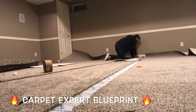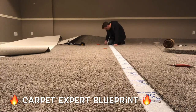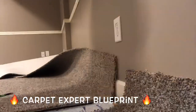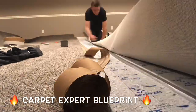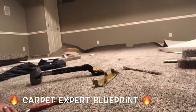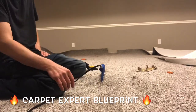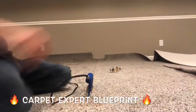So we got it all laid out. This particular carpet — I'm actually running a row and using a top cutter. This is unheard of in my world, but sometimes it's got to be done. This plush carpet has a row stitched into it; every other row is a different color. So you got to use a top cutter and a row finder to go ahead and separate the fibers and make sure you're getting the light on one side, the dark on the other side. When you seam it together, everything's good. If not, you could have two lights lining up or two darks lining up and you have a streak going down the room — all bad. So pay attention to that. It doesn't happen super often with plush carpets, but some of them are stitched that way.